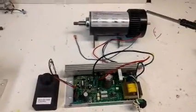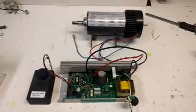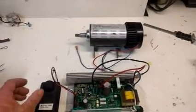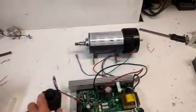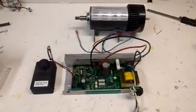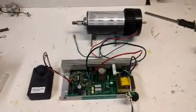I'll do it again and then I'll play with the speed control. Before, when I shut the switch off, the thing actually stopped fairly quickly. But if I stop it by turning the speed all the way down quickly, it ramps down very slowly. That's the minimum speed with the pulses happening — that's the minimum speed the MC2100 will actually run this motor. To stop it you have to actually stop the pulses altogether, which is not a problem — that's what my circuit will do.